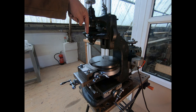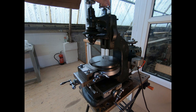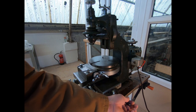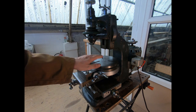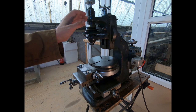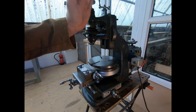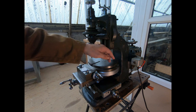So we've got up and down through this lever or knob, you've got cross-travel with that one, and then just the same as any normal milling machine — but it's got a built-in rotary table so we can revolve the head. It also tilts this way, that way, and that way, so you can cut angles. Stops everywhere.